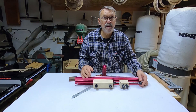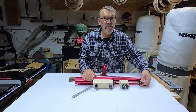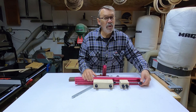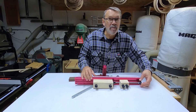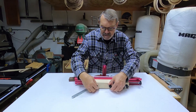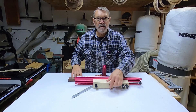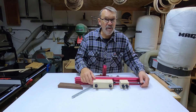I can either advance it in a little bit — as fine a measurement as I want. It's a quarter-20 bolt, so one full turn will give you 1/20th of an inch. I can count the number of turns, or make just a part of a turn, lock it back in, retest, make another cut, and see what I've got. I can back it off the other way too.